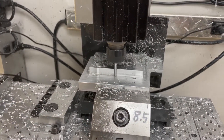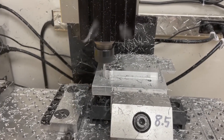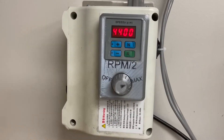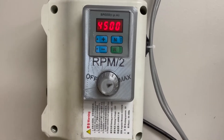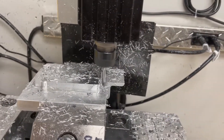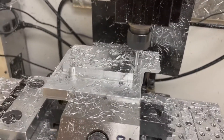You can hear the motor right about there. The motor loses a tiny bit, but it doesn't bog down too much. The RPM is doubled because I have a 2-to-1 on the spindle, so this same 4,500 RPM is spinning at 9,000 RPM. You can see when the motor strains it drops slightly, but it recovers pretty quickly. I think that's fine for a hobby machine like this.